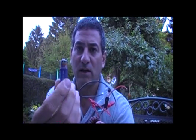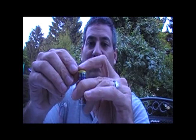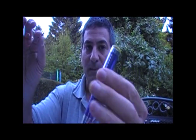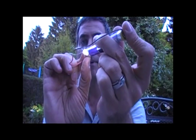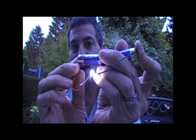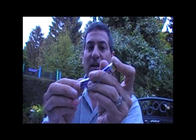This 3-volt LED can be lit with a low-voltage source like a 1.5-volt battery using the joule thief. Normally, if you try to take a 1.5-volt battery and connect it to a 3-volt LED, nothing happens at all. For this LED to light, you need two batteries — only when you have 3 volts will this LED light up. This is a bright LED, the kind used in the Khumbu for flashlights and room lighting in lodges.